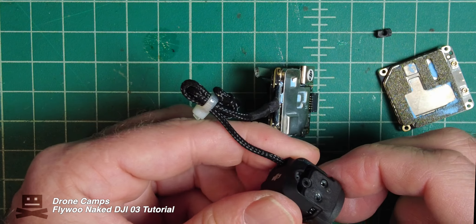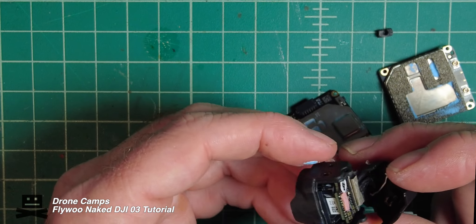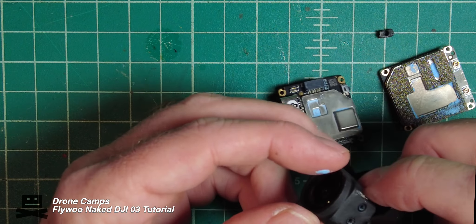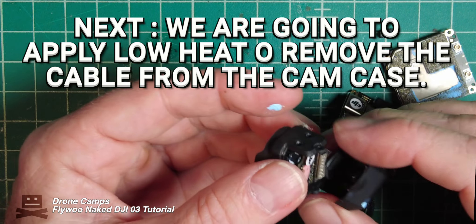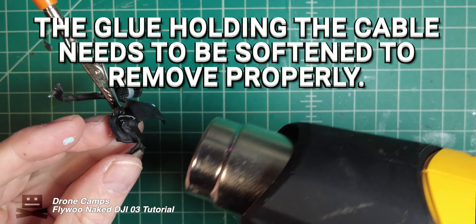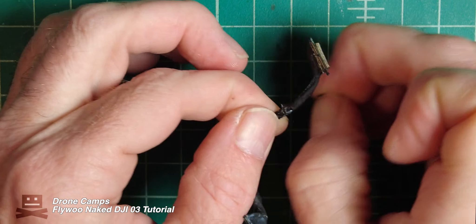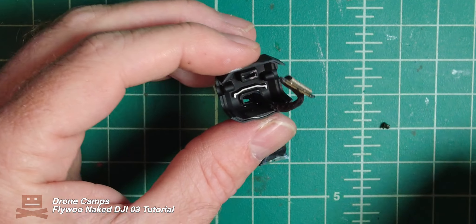At this point we're ready to go ahead and separate the camera — just pull it out like so. There's a connector here we're going to have to deal with, and there's a little bit of waterproofing right there — we may have to cut that but we'll see. We need to pull this front piece off — this is our camera shield. Go ahead and pull this connector off and separate the two. Now that pretty much pops right out and you can go ahead and remove some of this glue with your fingers — it comes off pretty easily. You don't want to poke around with your razor blade too much around this cable so that we don't have any problems severing it.